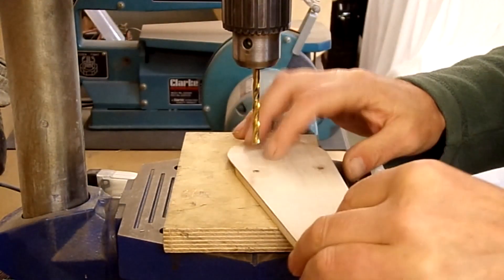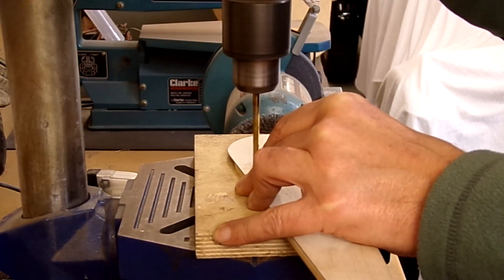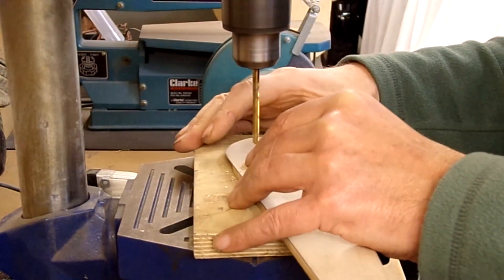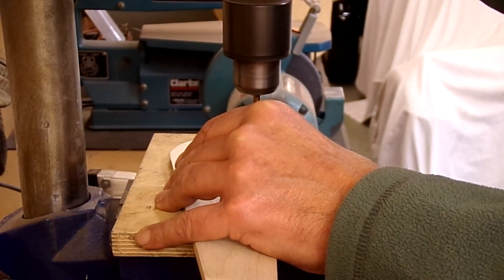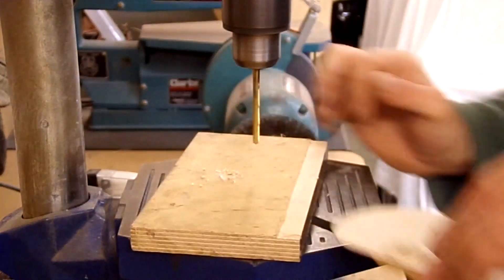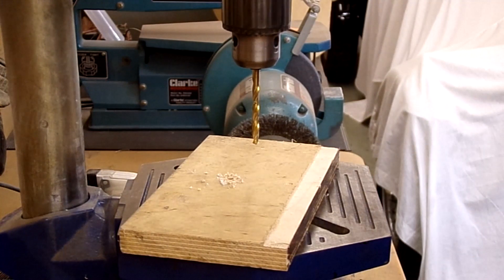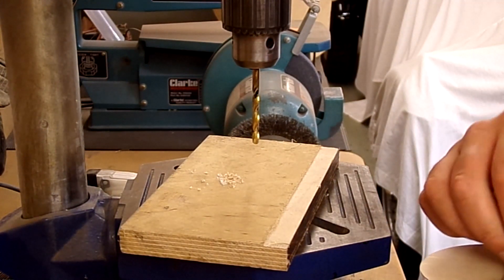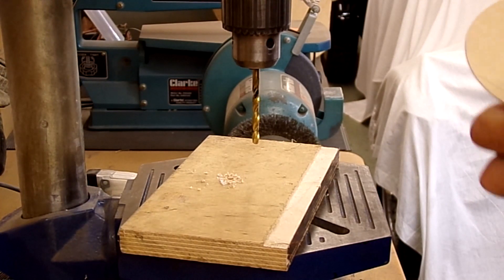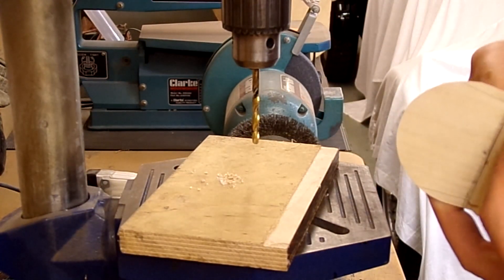Drilling the holes in the ribs ready to go — drilling through the pre-positioned holes and cleaning them out. In this case it's cleaning out to 5mm. Then hopefully these 5mm screws I've got are long enough just to grip these anchor nuts in place. I don't want the screws to be too long, otherwise they go into the locking section of the anchor nuts, so you don't want to be exercising that too often.